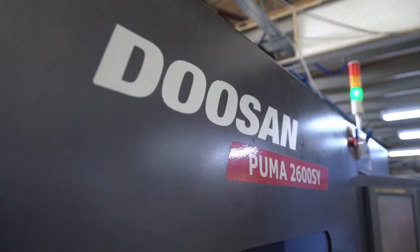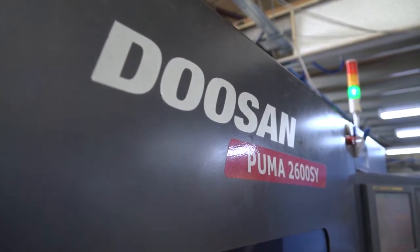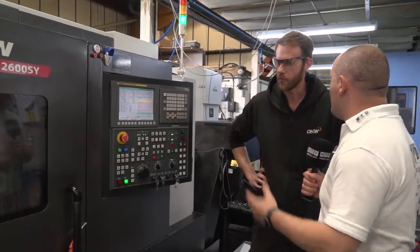That's a good endorsement because Inconel is a challenging material. And 40mm is a decent size Udrill. It certainly is — you do need the torque with tools of that size to be able to cut through. You wouldn't be able to do it on any of our other machines we've got in the factory at the moment. So yeah, it works really well for us. I don't know what we'd do without it, to be honest.